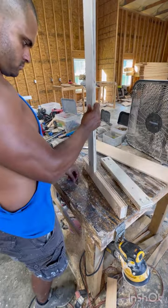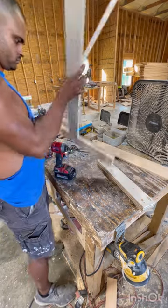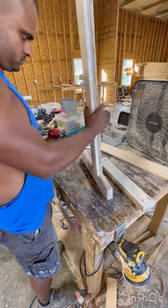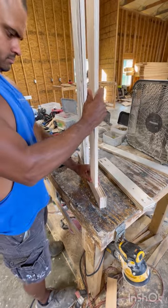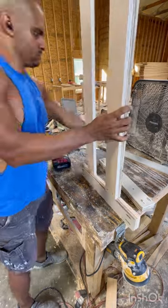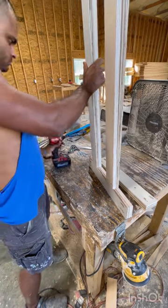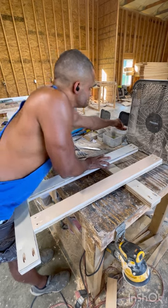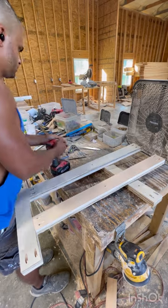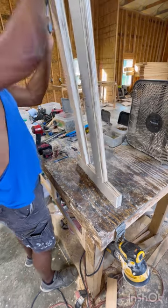Here I'm starting what I'll call the guts of the drawers — this is how I mount the drawers to the inside, the spine of it. I just use some birch — I have cutoffs from the CNC machine laying around. I made the bottom at the top, and this whole thing needs to be about an inch and a half wide because the front of the face where the drawers go is about an inch and a half wide, so I wanted to make sure everything was even.